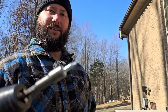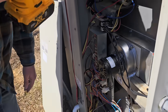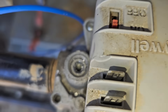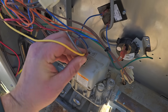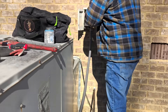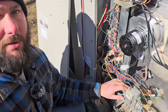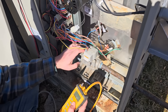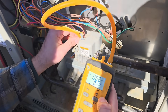I've actually never had to do this before — used a 5/16 self-tap screw and drilled a hole straight through that outlet screw. Now we're ready — see that? Hole straight through it. I'm going to plug these wires back up and turn the gas back on and plug it back in so we can measure that outlet pressure. I'm just going to put my finger right here because you'll be able to feel the gas coming out, and then I'll put my tube right there.